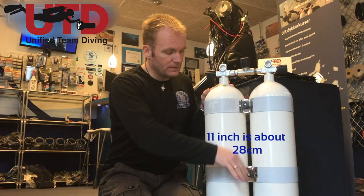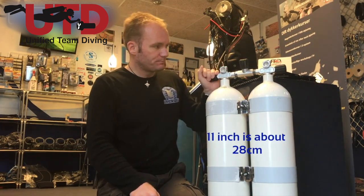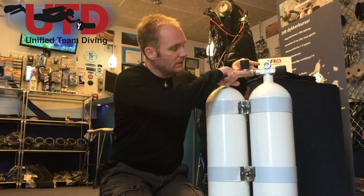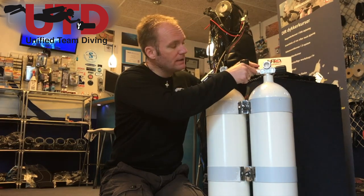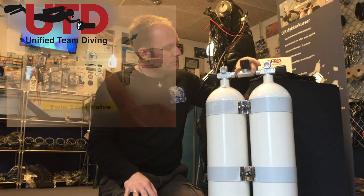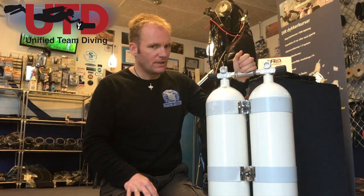The tanks are 11 inches apart so they match up with the holes in the back plate — that's an industry standard. The valves need to be lubricated, and we prefer this type of manifold where there's a tap going in with two o-rings. These two lock nuts are not locked. When there's pressure on it, you can still move the manifold, and that's intentional — if you hit it, the chances of the valve breaking are less. This is actually the only single-point failure on a twin set, and it should be able to move while still being airtight.